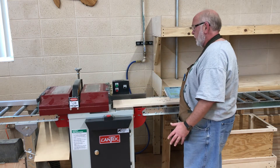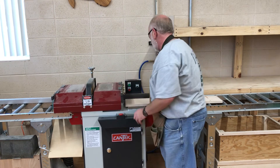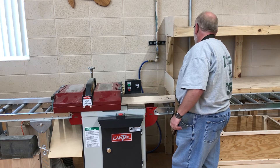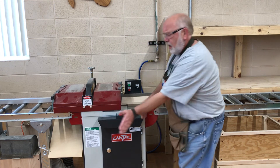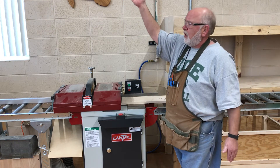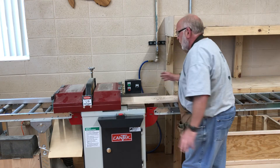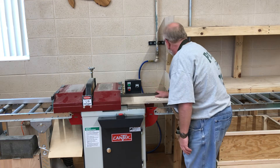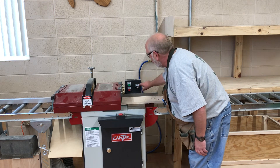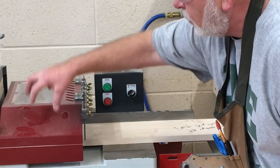The first thing we're going to do is make sure there's no scrap wood up inside — there are two pieces of glass, so make sure there isn't any. You can't really reach up in there, but take a board and clean out the scrap to make sure no scrap wood is in the cutting area. This is called an upcut because the blade literally goes up into the board, whereas the miter saw blade goes down. Step one: make sure the scrap wood is out. Step two: turn the air power on — we have a gauge right here because this machine is run through air power.